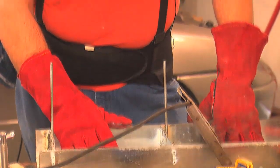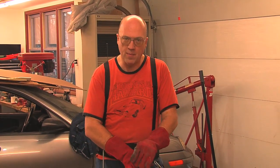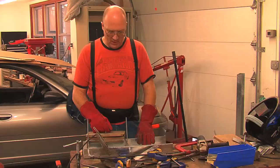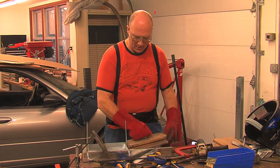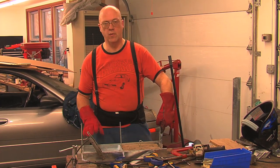Since I wasn't going to guarantee precision, I'm going to line the trays with a quarter inch thick layer of closed cell foam. I found a local foam store that had these sheets. That's going to do a couple of things: first, if the trays aren't perfect that will take care of the difference and let the batteries slide in. It will keep the batteries from rattling around, and the sheet on the bottom will raise the battery up enough so I can put bolts through the bottom to hold these down inside the car. I put the block on this side, put the other plate, clamp it all, weld it up, and the whole tray is done.